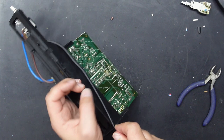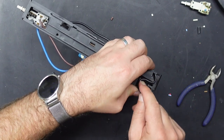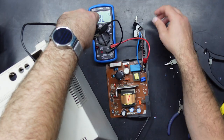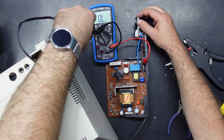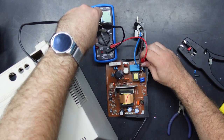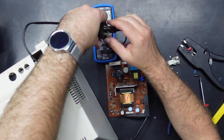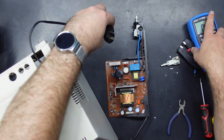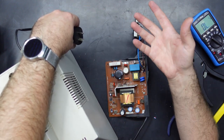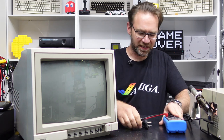This needs to feed back around through this little maze of stress relief. That seems good — no connection there. That seems good. This will now be safe to plug in, assuming there's not something else wrong with the CRT, because I haven't actually plugged it in yet, so that'll be interesting to find out. One more quick test of the switch — that's good.